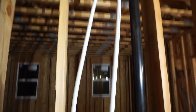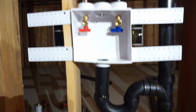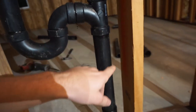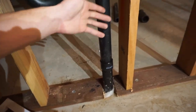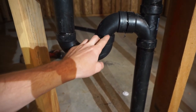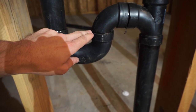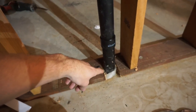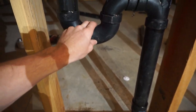While we've shown how we're getting water into the house, there's a whole separate side: getting water out. Here is one of our drains — this is for the washer. It's the bottom of this box that will be hooked up to the washer later. Water flows down and through to underground, which is sent off to the sewage — we have a septic system. This is called a P-trap. Water flows down and has to get to a certain level to flow up and over; when it runs out, it leaves water about this high, meaning the entire piece is filled with water, which blocks gas that might vent up from the sewage from entering your system.